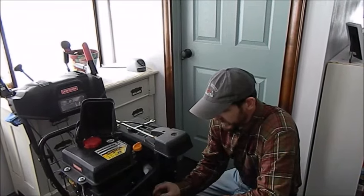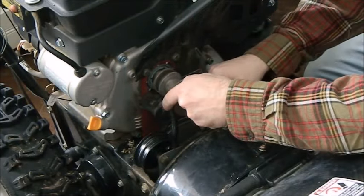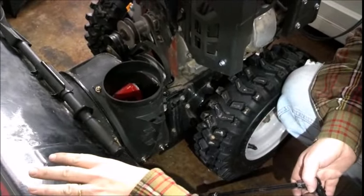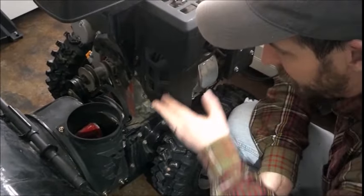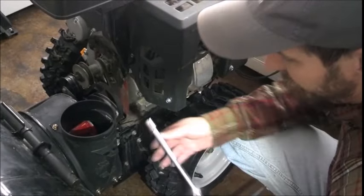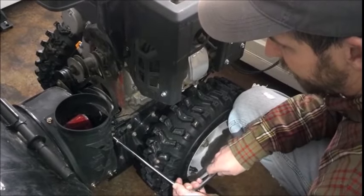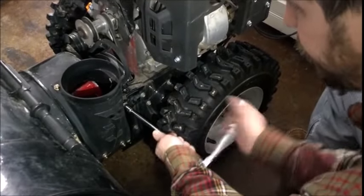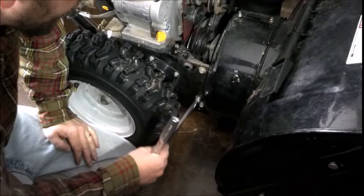What I need to do is take this belt here — it is a little bit loose but it's designed that way. It looks like there are only four bolts holding the auger system to the motor mount and the actual snow blower. So I'm going to take out these two right here — it's a half inch. I've got an extra long extension so I can get around these wheels, which makes it a whole lot easier.